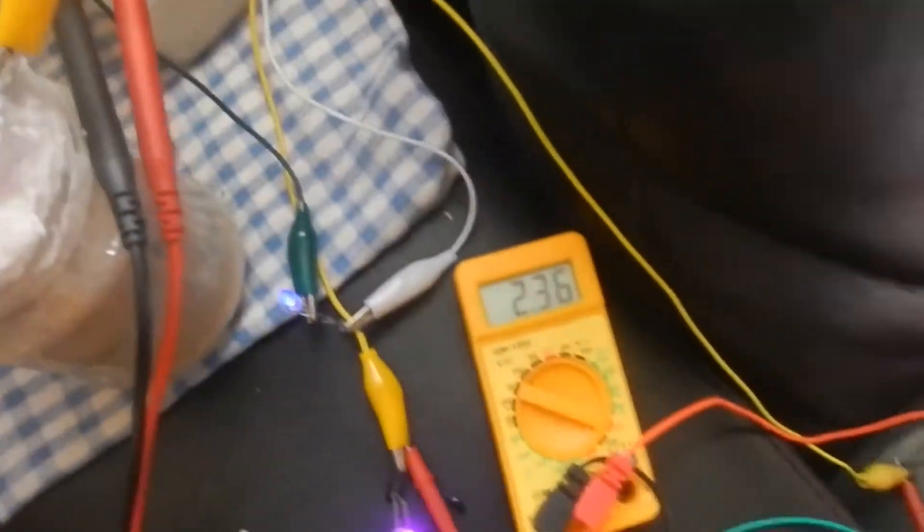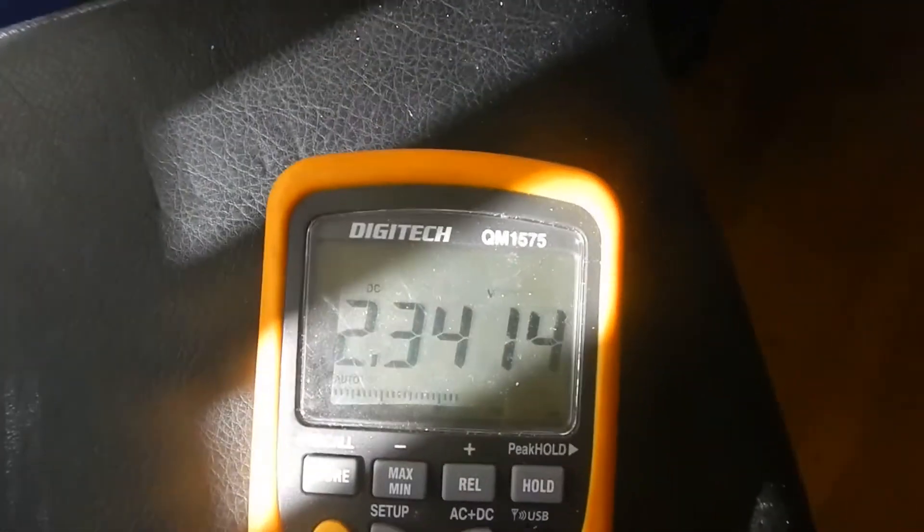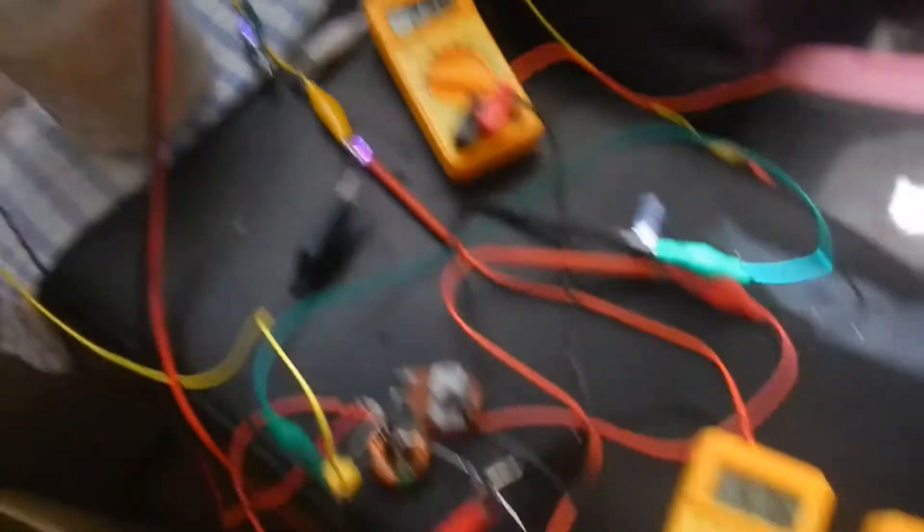They're about 1.8 volts static; they need 2 volts to charge, as you can see on the metres here. It can get quite small — I've only got the two jumper leads going down to one of those batteries there. I do have 2.34 volts charging up into that. I've spread it out a bit down here with some metres so we can see what's going on.